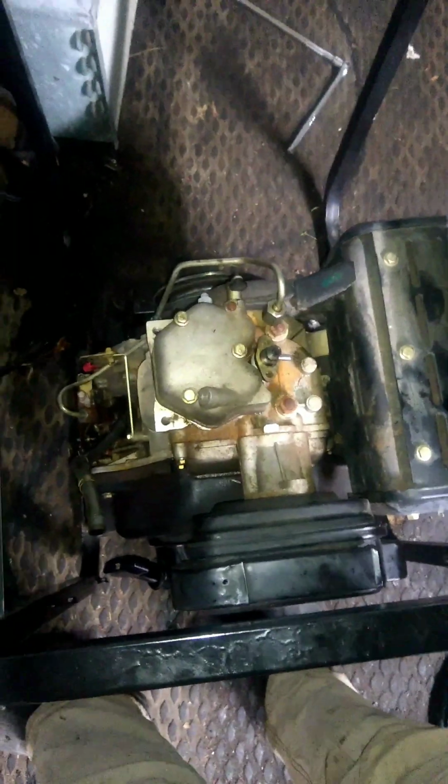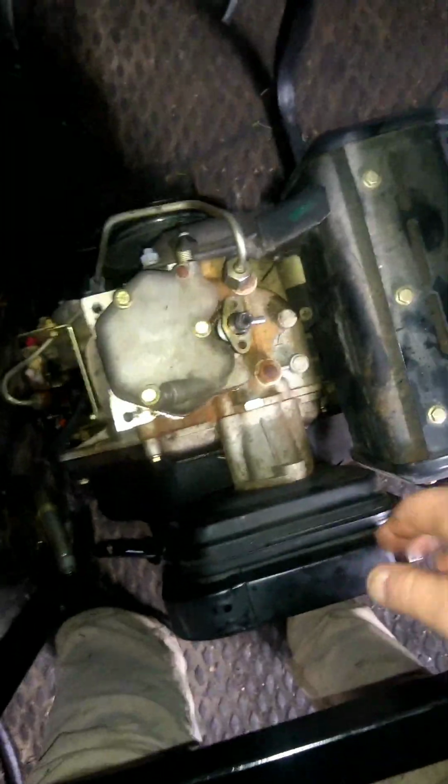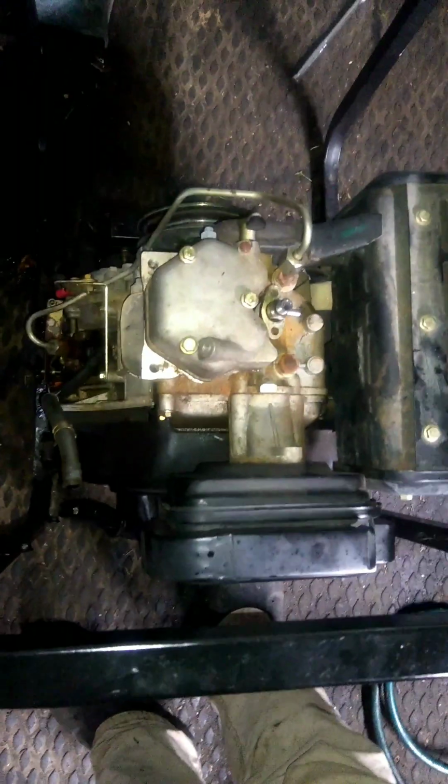So the reason why I'm making this video, I did mention that I had some issues with it. One issue today, it shut down on me. It took about 10 minutes to finally slow all the way down to nothing. It was starving for fuel, so I'm like, all right, probably clogged up the fuel filter, or maybe we're starting to damage the fuel system components, which are very inexpensive. That's why this is the test subject. This injector costs about 20 bucks to replace. That injection pump also costs about 20-something bucks to replace. So very low risk. That's why I was playing with this. If we break it, that's almost a good thing, because yeah, you have to spend some money on it, but you're learning something.